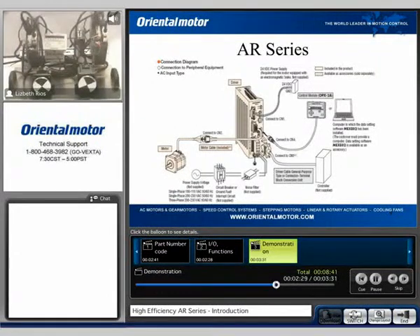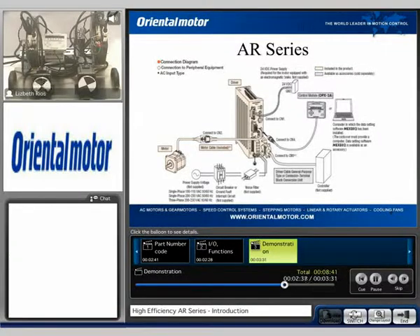I can go ahead and rerun the program. Half a rev, and then it's going to loop counterclockwise a quarter of a rev. Then it's going to index in the positive direction an eighth of a rev. At the end of the program, it's going to go to the absolute movement of 30,000 pulses in the positive direction.